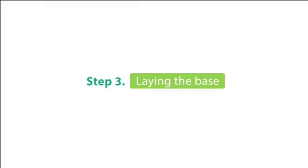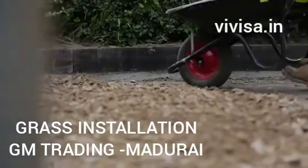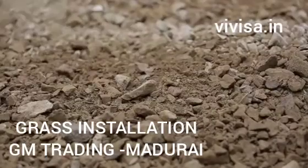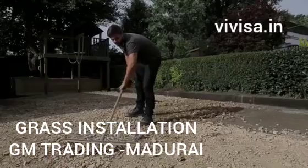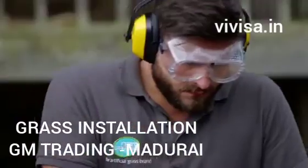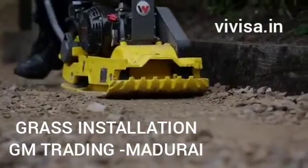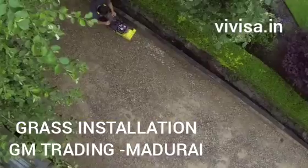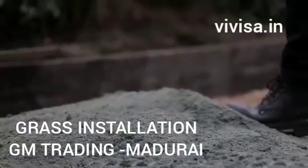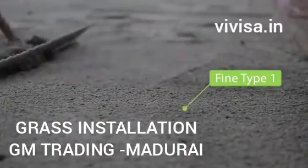Step 3, laying the base. This garden needs building up more than 50 mils, so we're installing an initial layer of heavy gauge type 1, which is raked and leveled before being compacted. But in most cases, just a single 40 to 60 mil layer of fine type 1 or similar will suffice.